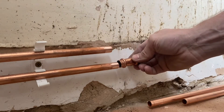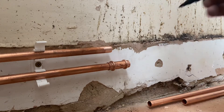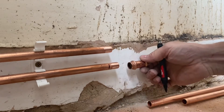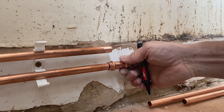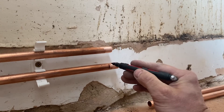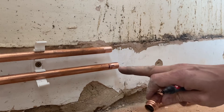The first thing you do once you've prepped your pipe: offer your fitting on, and when it's on all the way, mark the pipe and then check it that it's gone all the way in. At this stage when you're checking it, some guys like to put an extra mark on the inside of the fitting because after you've pressed it there's no way you'd be able to make that mark.